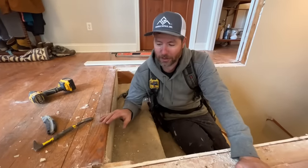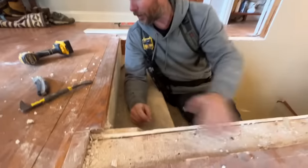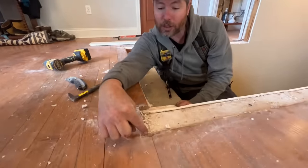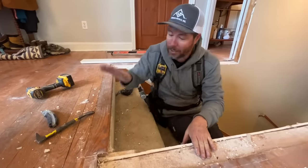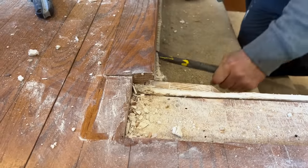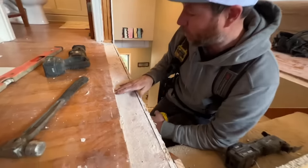One other thing I've decided to do is remove this piece of flooring because it doesn't have a bull nose like it should, it's already worn out and gnarly looking, and I was thinking we should just cut this piece of flooring here and go straight across with a new one with a mitered corner so that here, here, and here all look the same. Careful — that was awful crunchy.